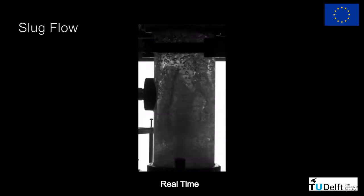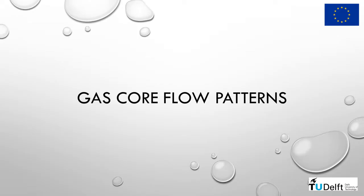If the airflow rate is further increased, the bubbles can no longer be kept separated and the flow transitions to a slug, where a piston of water alternates with a large bubble that occupies the majority of the pipe cross-section. Each flow pattern upstream the separator has a different impact in the core created inside the equipment, as you're going to see in the next videos.